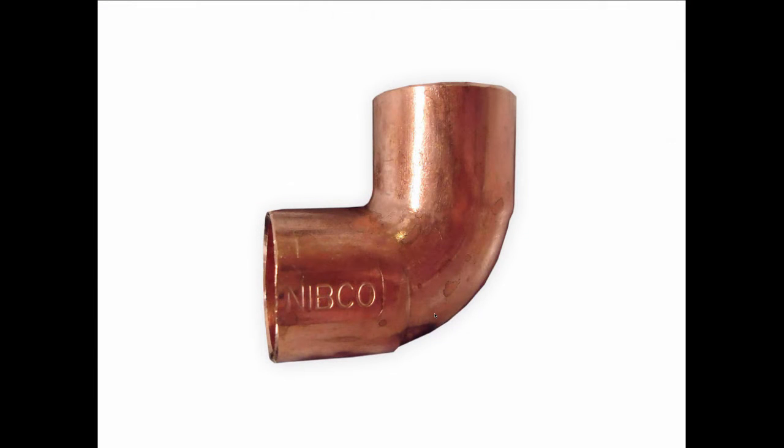And then he said to me, okay, you're going down the pipe, and you could feel what it's like where the outer edge of the water is rubbing against the inside of the pipe, but the inside of the water flow is kind of getting a free ride because it's not touching any of the pipe. But then you get to an elbow, and what happens? And I thought about this for a second, and I'm thinking bumper cars, and imagine the water comes zooming in here, and it smashes into this wall to make this turn, and suddenly you've got all this turbulence going on inside here, and more of the water touches more of the pipe, so there's more friction.